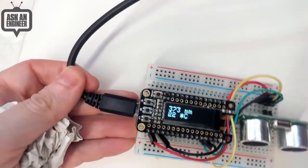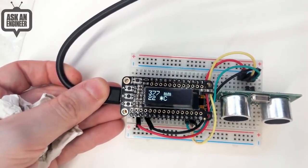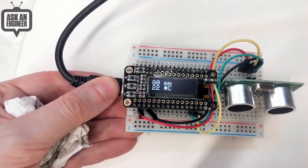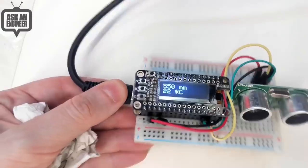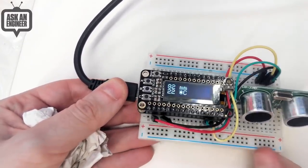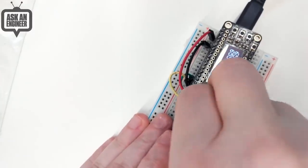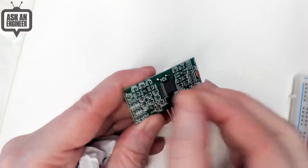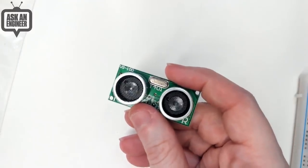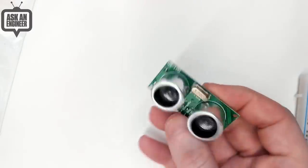As I move my hand back and forth, it's quite fast and responsive — you can update it maybe 60 times a second or faster. It also gives you the temperature, which in this case is 22 degrees centigrade. This is using the UART mode. You can always use it in the old-style HC-SR04 mode as well — on the back there's a jumper; remove it and it's in standard mode, apply it and it's in UART mode. Another nice detail: you can run it at 3 volts. The HC-SR04 is 5V only, but these can run at 3V or 5V, so they're kind of an upgrade — if you have a 3-volt device, you don't have to deal with resistor dividers.